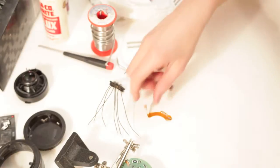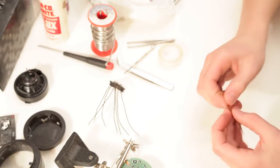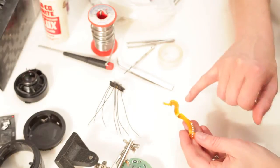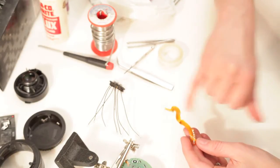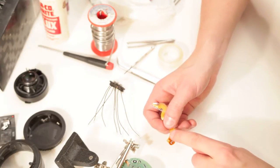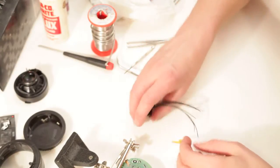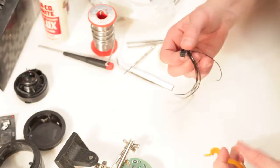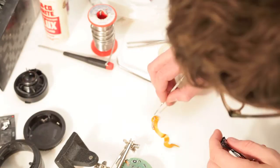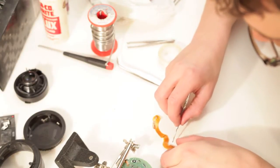I taped this ribbon back together just to use as reference, because we have to make sure that all the wires don't just go from left to right — they attach and start at different areas. This one starts on the far left but loops in and comes in on the second one, so you have to be careful matching all the wires up. You won't want to solder this very long because you can cook the board.